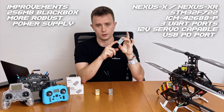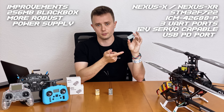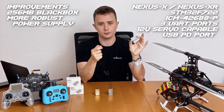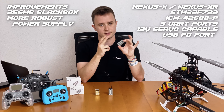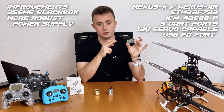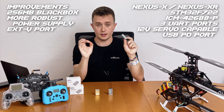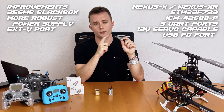There have also been upgrades to the safety of these devices. The 5V rail, 3.3V rail, and 1.8V rail — which are responsible for driving the MCU and the IMU — have all been upgraded to better, more robust power supplies, which means these devices can take more abuse and more voltage ripple without failing.